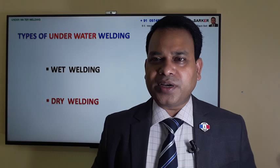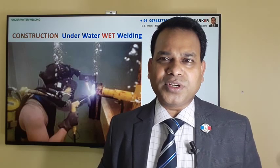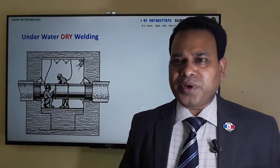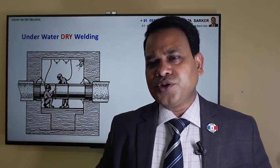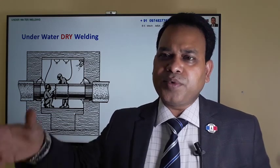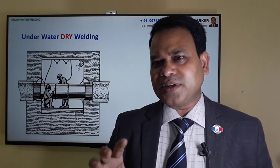There are two types of underwater welding. One is wet welding and the other is dry welding. In wet welding, as you can see in this picture, the pipe is bare and the welder is exposed to the water environment - the rest of the process is very similar to normal welding. For dry welding inside the water, you have to put special equipment - split into parts and mounted on the pipe to be welded. It is made air-tight and the water is pumped out, making the system equivalent to a dry environment.